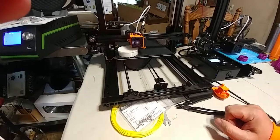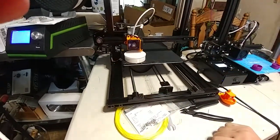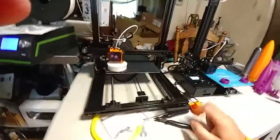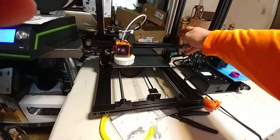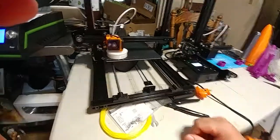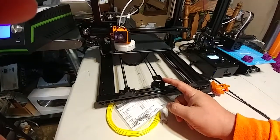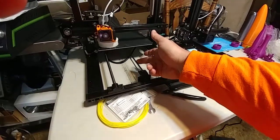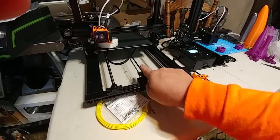For example, this moving up and down would be a load bearing part. This frame bending would be load bearing, so the frame would be load bearing. The x-axis would be load bearing. These wheels have a load — that's why they have to be tensioned. This belt is load bearing. You don't want this being plastic, even molded plastic. You want this being metal because there is actually a significant force on this belt that's constantly attempting to pull this bracket that way.